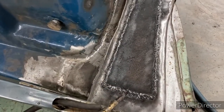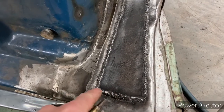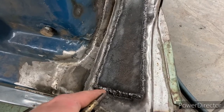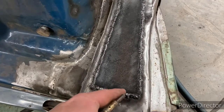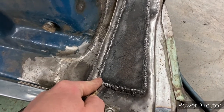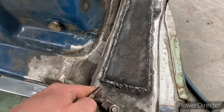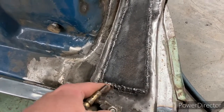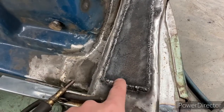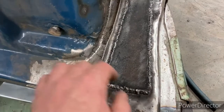Play around with your distance between the nozzle and the work. Where the gap was larger I just pulled the nozzle away and dropped the weld into the gap rather than getting real close — close means lots of heat and it's going to make the hole bigger. Pulling it away reduces the heat to the source. If you have to, grind it down and tack it again.